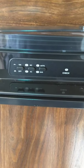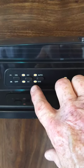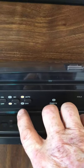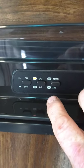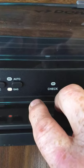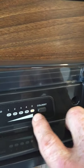The refrigerator is a three-way refrigerator. It'll work on LP gas, 12 volts DC, and 110 AC. This is the control panel — this is on and off; now it's on. You'll select what source you want. If you put it on auto, it'll search for 110 AC first, and if there's no AC power, it'll switch to gas. Right now, because there is AC power, that one lit up showing you you're running on AC. You can also shift it to DC, so if you're pulling it down the road, you can use your battery and alternator from your tow vehicle. And then you can light it dedicated on gas — though you can't pull it down the road on gas. Usually you're going to have it on auto and running on AC. You'll have the temperature all the way up; if it gets cold outside you might back it off a bit, but generally it's going to be up all the way.